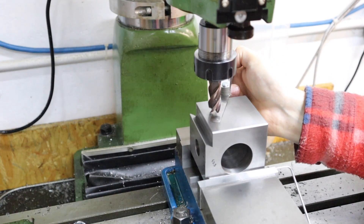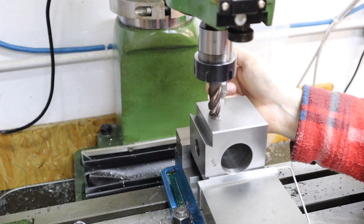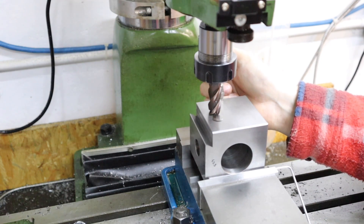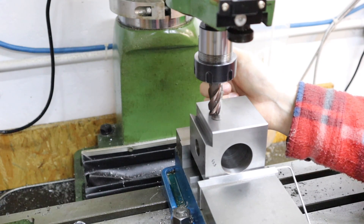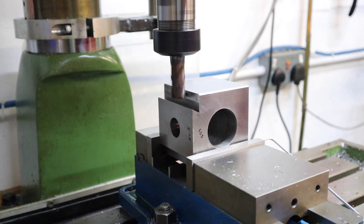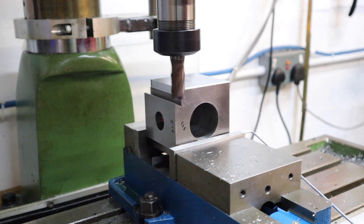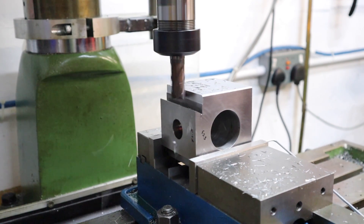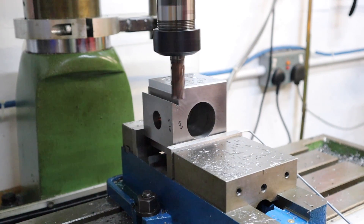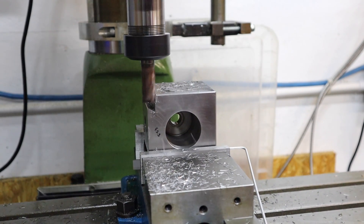Not before zeroing out on the workpiece first. To do this I'm using a little method I've seen on YouTube - I've got a feeler gauge with 0.05mm shim stock and getting it so the end of the mill just touches the piece. With that done you can come down on the quill and start hogging out material. Because I'm side milling, this can only take very light cuts at a time - about 0.3 to 0.4mm - so it's going to take several passes before this is machined down to the distance it needs to be.